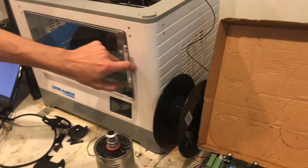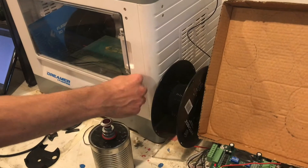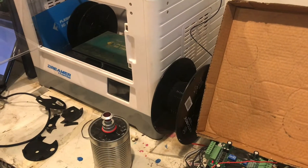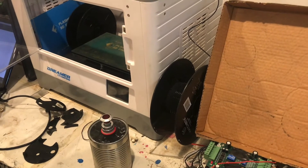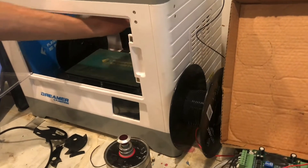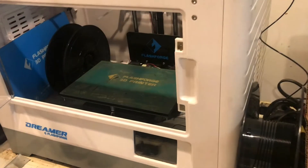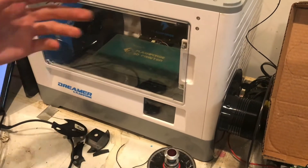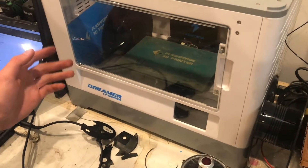If you had a box around your CNC machine, you can have a little switch inside the door. Whenever you open it, it would stop what it's doing, turn off the spindle and coolant. You can even program it to park — move the spindle out of the way. Then you close the door, press cycle start, and it will resume right where it left off. Kind of nifty.